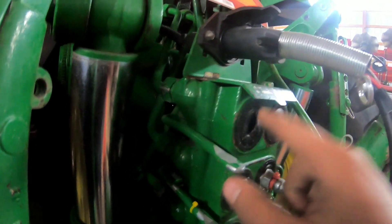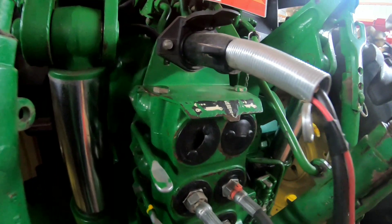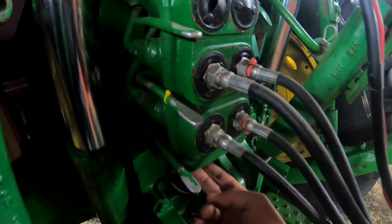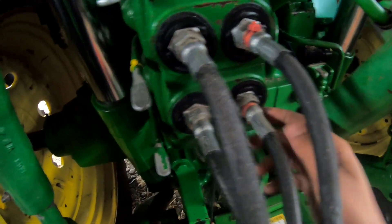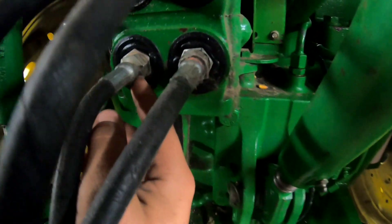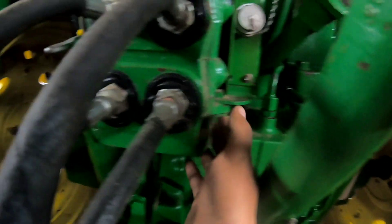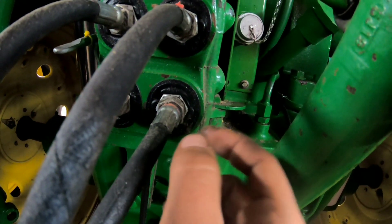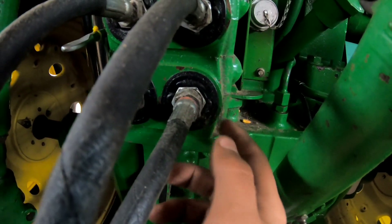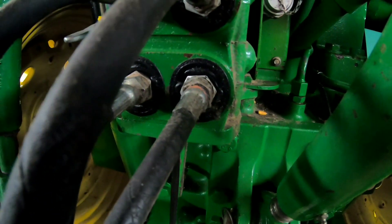This one - the top set does not work. What me and the mechanic are doing right now is going through them. On the 7200, this one here is not staying engaged or locked in - it wants to keep blowing the hydraulic hose out. Yet this side over here is staying in. There's a spring in there - you take this out, there's a spring on the back side, you take it out, you gotta do a snap ring, you take it out, push the spring in over top of the keeper that runs this thing, and push that back in all together. It is not fun - not something I wanted to try doing myself.